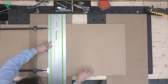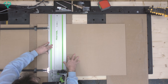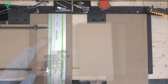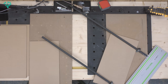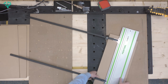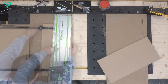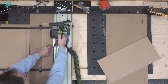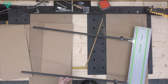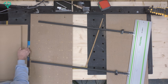I can just slide the board down without resetting anything, bring the track in again, make sure it's all nice and flush to the end, bring the track saw in, and make sure I'm looking good. And there you go — that's the promise of a parallel guide system: you can quickly set it up once and break down the boards multiple times.